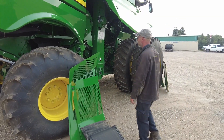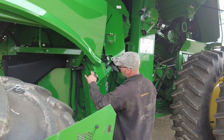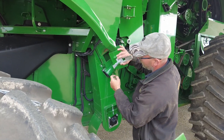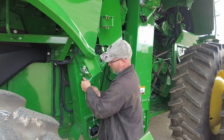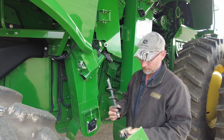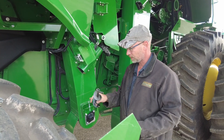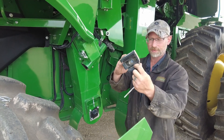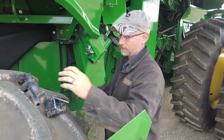As we come around the right side of the machine, we get into our elevators and our clean grain cameras. Open up your cameras and make sure that your sight glass is clear and clean in here. Another good thing to check is to pull the augers out — they get built up with junk left in there from the year before. I did have a few machines last year where they said the auger quit turning and it was throwing them a code. What happened is it built up with debris down the bottom section and the auger would not spin like it was supposed to — just bound up from old material.